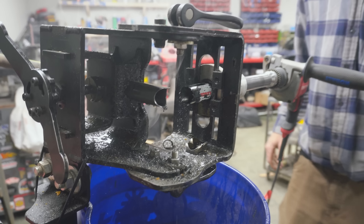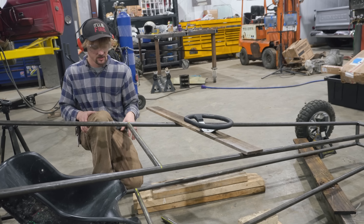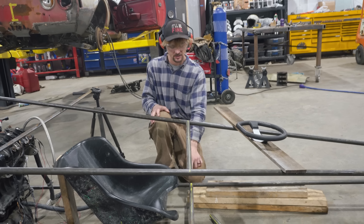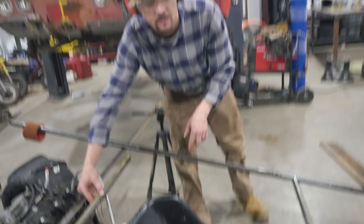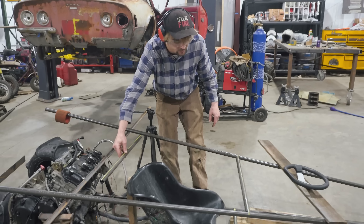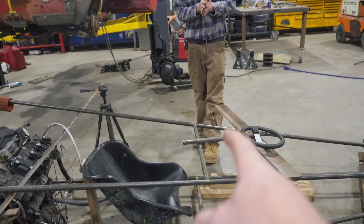I like notching thin tubing — it's a lot easier. We might have to move some stuff at the back because we hadn't set it up for the width. But from this point on, basically we're going to bend it here and get back here to touch again — the top bars and the bottom bars. So we're squaring it, taking the wedge out from this point and squaring it up. It's going to be square in the driver's seat area. I think we need to get some uprights.